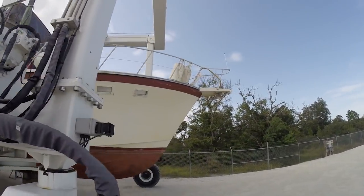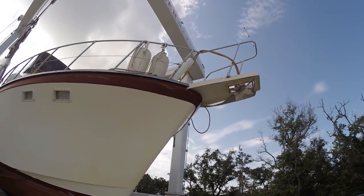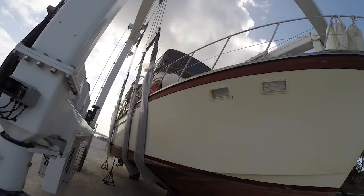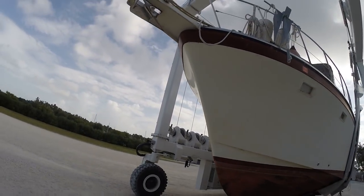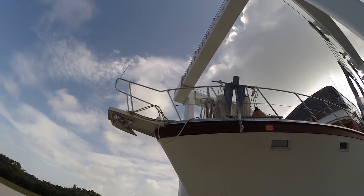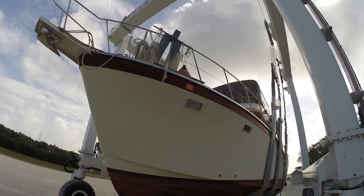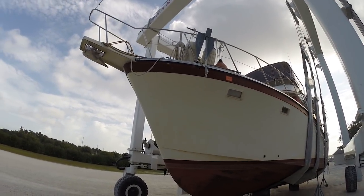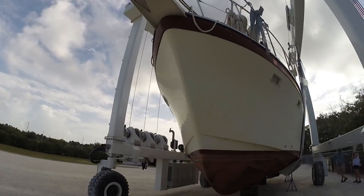The anchoring system — you've got a plow anchor, 280 feet of 3/8 triple-B chain. There's your v-berth lights. There's another anchor down below — looks like a Danforth to me; comment below if you know what that is. He's got about 250 feet of three-strand five-eighths rode in the back for the safety backup anchor, with 60 feet of chain, and then he's got another little anchor for a stern anchor.